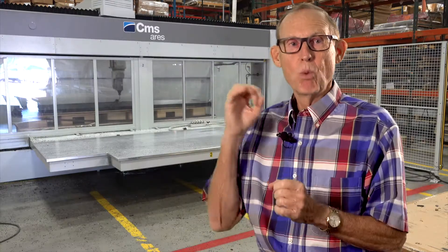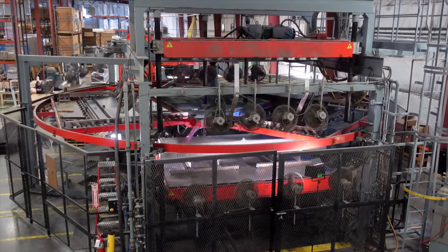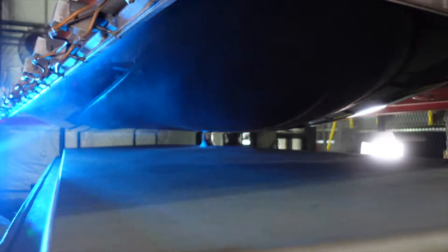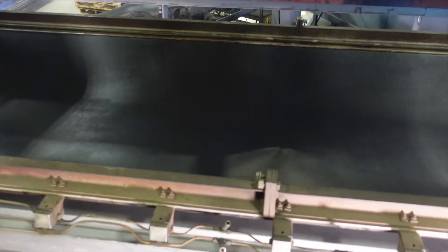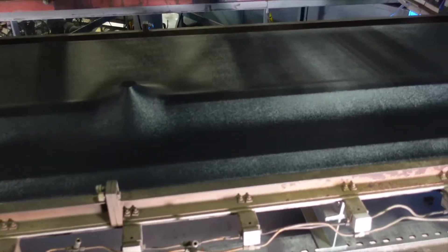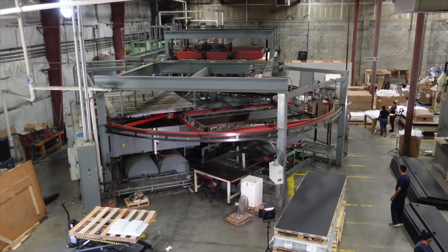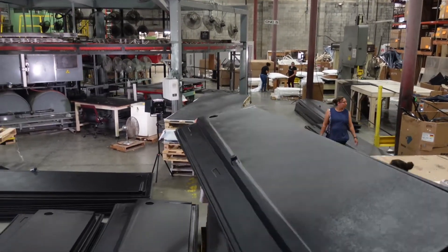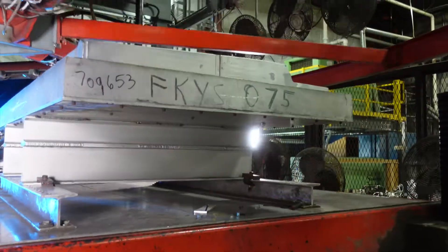As a rule of thumb, the more you manipulate those resins, the more stress you're going to build into a part. Thermoforming is fairly low pressure. Your vacuum form part doesn't have any pressure — it uses a vacuum to evacuate the trapped air. We do use pressure to force the material down in some of our processes, but we never get the material past its deflection temperature, and that's the key to keeping the stress out of the part. The material is heated in accordance with the sheet manufacturer's instructions for the deflection temperature.